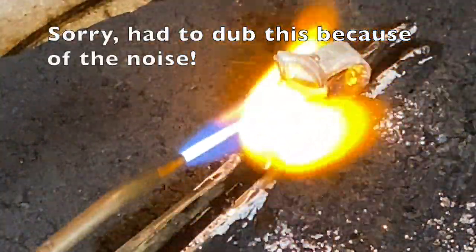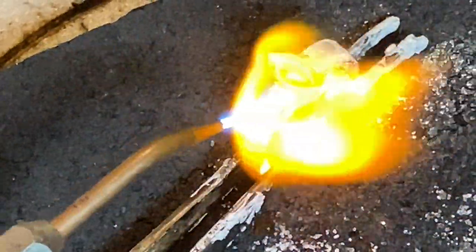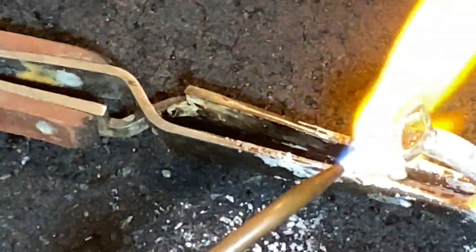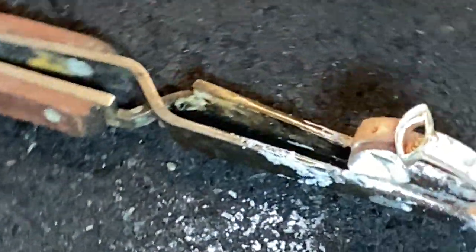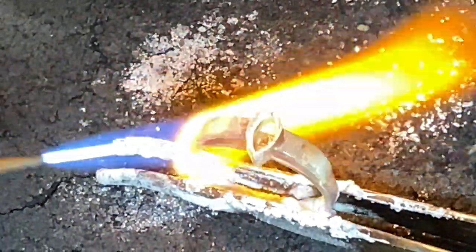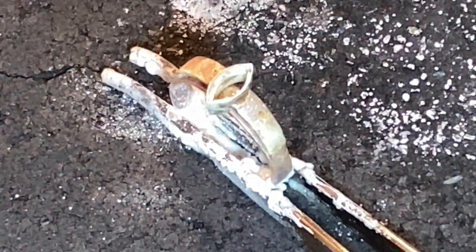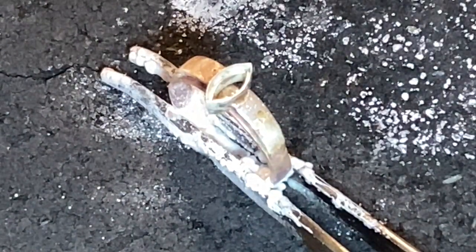Remember to think about thickness of metal — keep the tip of the torch on the heavier metal, which is the shoulder. To drag the solder around the edge of the bezel, you need to drag your torch tip as well, but keep the blue part of the flame on the shoulder, not on the setting. Now move to the other side. Always keep an eye on that bezel — even if your torch tip isn't there, it just takes a second and it's destroyed. That looks good — but keep your fingers crossed at all times.